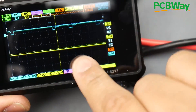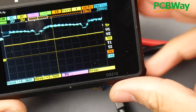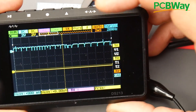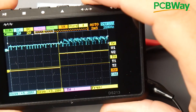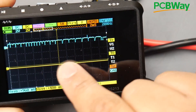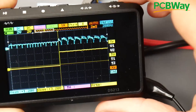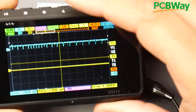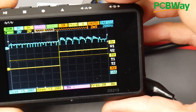After giving power, we can already see the video signal and the LED turning on and off. We need to make more sense of this, so first I'll capture more data by setting it to 2 milliseconds per division. The software is still a bit buggy but gets the job done. We'll use single mode to capture one waveform. I need to see the trigger level — that yellow line — and set it so that once the voltage rises above it, it triggers and takes the sample.